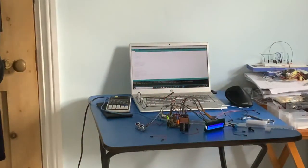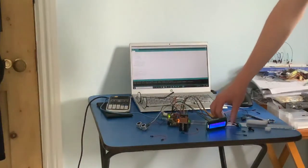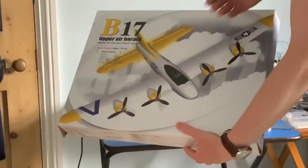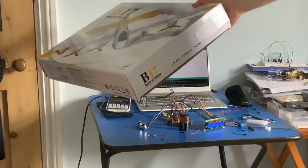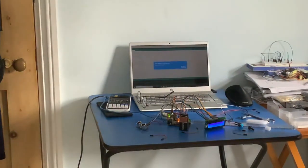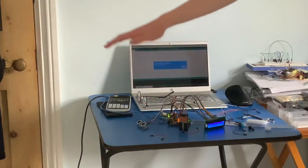So I've switched to the ultrasonic sensor, and I'm starting to work on a display to show the distance behind someone. This is a quick test to show how the earpiece produces a sound proportional to the distance of an object behind. I'm going to use this handy B-17 box, which is a remote control airplane I bought a while ago. When it's over a meter away, the speaker produces no noise. You can see that the frequency of sound produced by the speaker is directly proportional to the distance that the ultrasonic sensor is from an object.